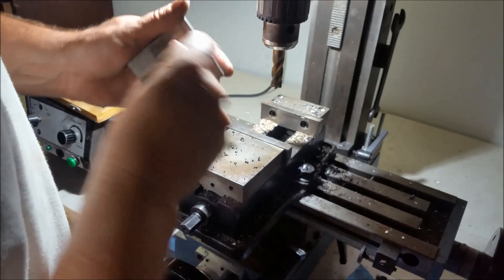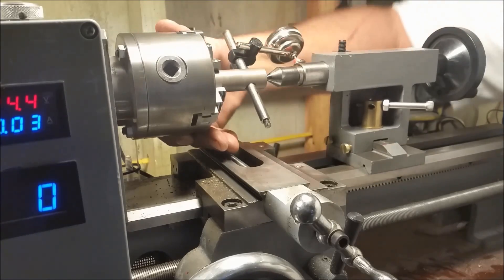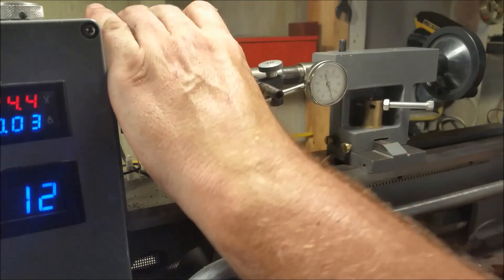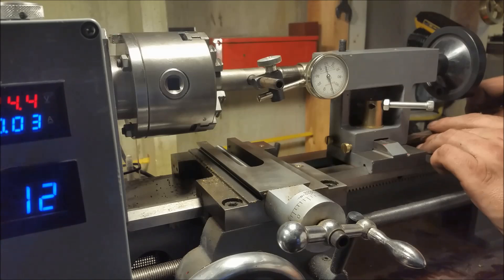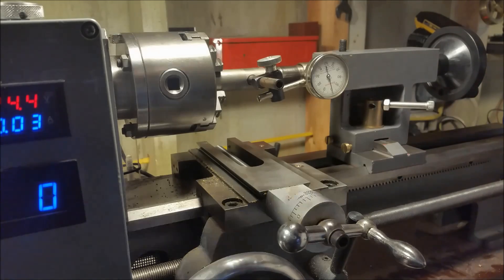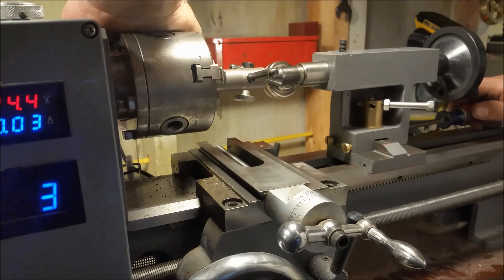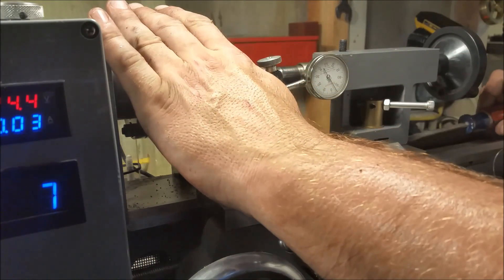After the milling operation we're finally ready to go ahead and center. We've got the four set screws and we've got our tool that we've made set up, and we'll go back and forth — it's a pretty tedious process. There's more than one direction here: you don't just have a slide, you also have a tilt. So you can be out of the direct line, and you can also be crooked. And here's another thing — when you extend your tailstock there could be a difference, so it could be a crooked parallax where you have it perfect, then you extend it and it's way out again.